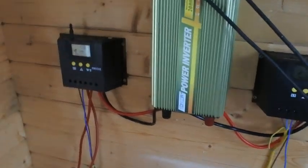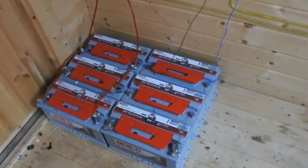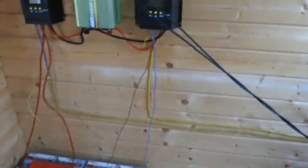At the moment it's running on normal power. I've got the sockets up here which are on the solar, that feeds over to the 2000 watt inverter. My battery bank is here, and I'm toying with doing an 18650 Tesla-style battery wall on here.